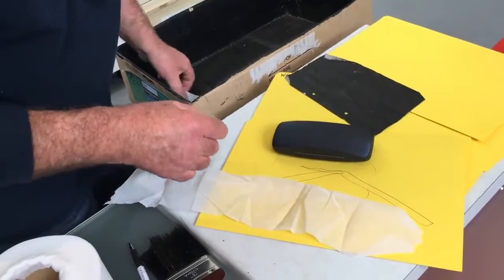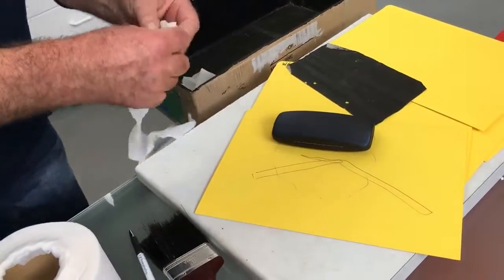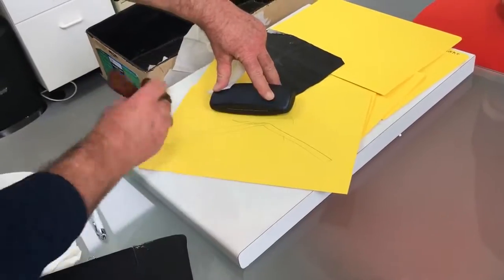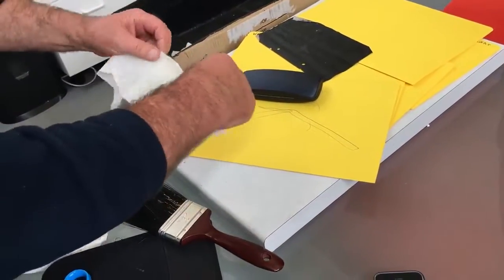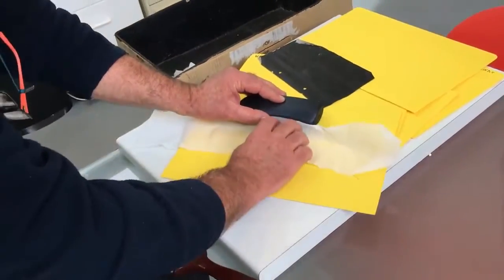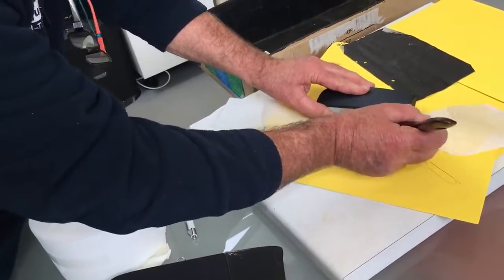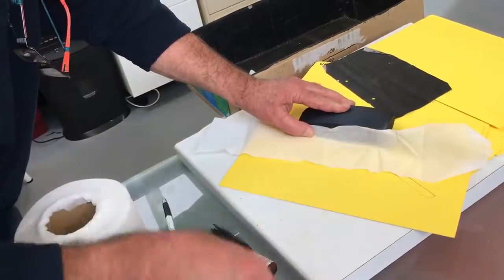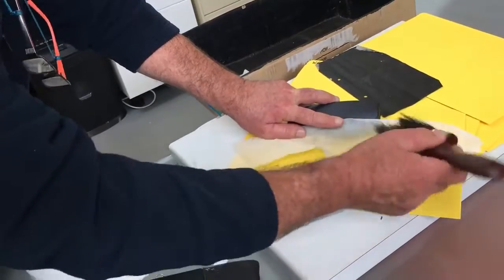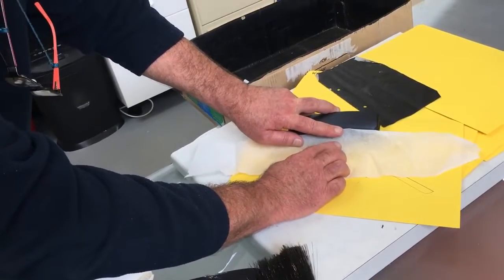But what you do is, once you've cleaned this, and this is clean as well, you'll get your bandage, and again you wet that down with a coat, so you work the material in there, brush that all in there like so, it's all nice and wet, and you'll have your piece of pre-cut material, you'll lay that in, so that it comes just shy of the edge. Okay, so it's actually up over the wood. That's right, yeah. And again, pushing that into the joint, nice and tight in there. You don't want it sitting like this, it's exaggerated. But if you were to finish that and have it sitting there like that, so it was hollow underneath, that's a bad detail. Okay.